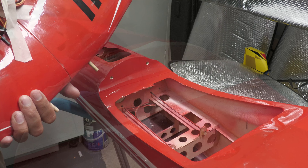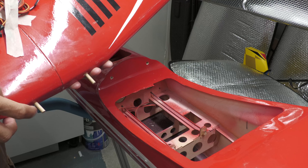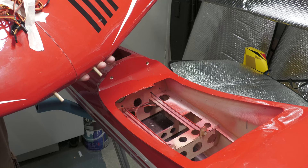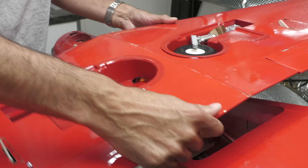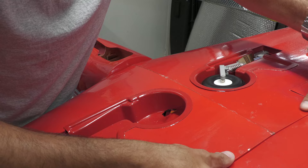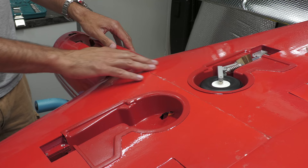Here we go guys — you can see that I've put the dowels in, 6mm holes, leaving about 20-25mm out, and I've just rounded the ends off very slightly to help them. I've drilled the two 6mm holes in the front, although I've opened them up to 6.5mm which will give me a little bit of room. Let's see if it fits — and it does, of course, because I've already tried it. Let's get the back of the line and it goes down nice.